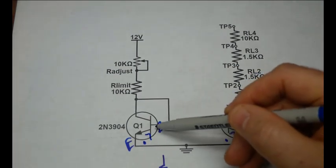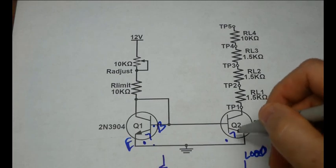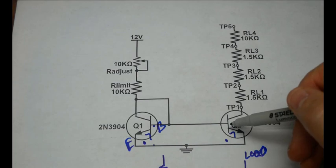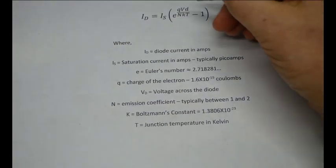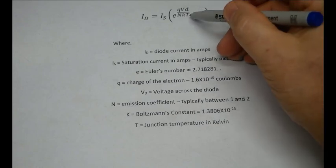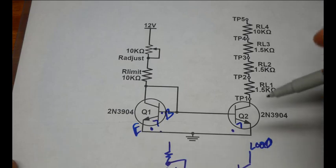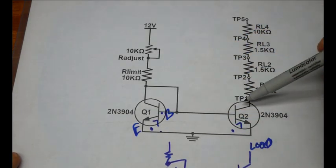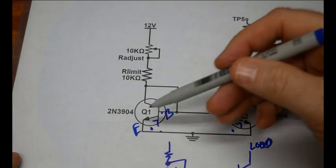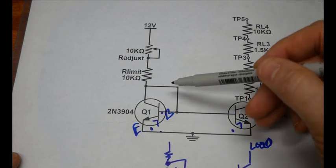The base-to-emitter is going to drop a voltage, and we want matched sets. If we drop 0.7 volts here, we want to drop exactly the same 0.7 volts over there. If this one drops 0.65 and this one drops 0.7, there could potentially be a difference. However, the idea is that the voltage from here to here is fixed by this string, and this fixed voltage should mirror over here. We want to match betas and everything we can, and we want to keep both at the exact same temperature because the diode equation has a function for temperature. Ideally any current mirror is going to be built on an IC so the die is very small and everything is very close together. We've taken this collector, shorted it out, and made essentially a diode out of the emitter and base of Q1.